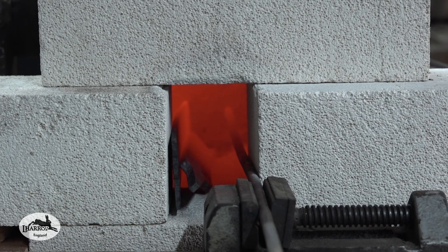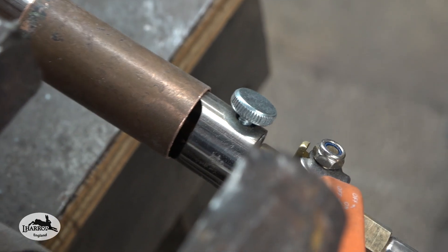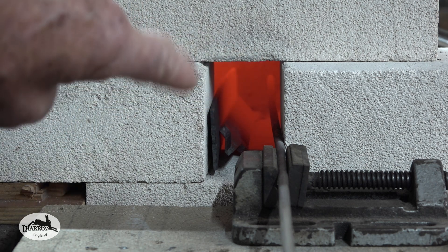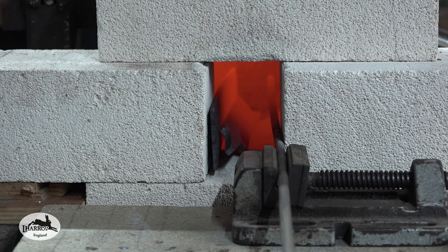Very, very small amounts of gas are going into that burner. The copper pipe is slid down, allowing just that much air to get in. If you reduce the burn rate too low, the burner can go out but still allow gas to enter — but when the forge is at this temperature the gas reignites again, so you won't get a massive explosion. But with gas, without regulators, valves, and thermocouples fitted on the line, I never just walk away and leave my burner.